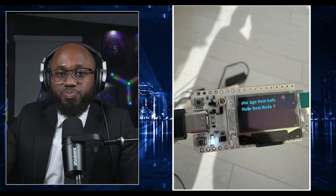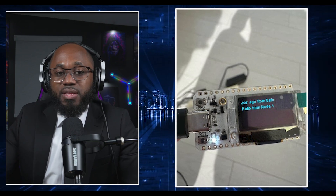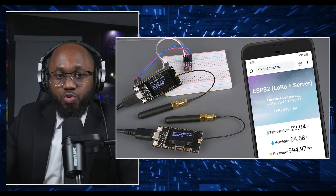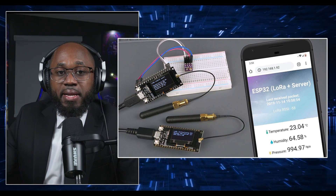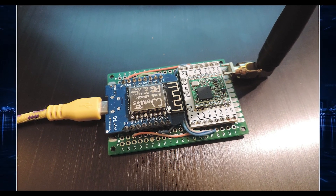Configure and test by setting device parameters — region, channel, power, etc. — via the MeshTastic CLI or app. For the mesh network, power on multiple nodes to form an automatic mesh. Test communication by sending messages or data between nodes using the MeshTastic app or CLI. For off-grid deployment, enclose the node in a weather-resistant case for outdoor use. Mount the solar panel in an optimal location for sunlight. Monitor battery and solar performance — many designs include voltage and current monitoring. Deploy nodes at desired locations to maximize mesh coverage.